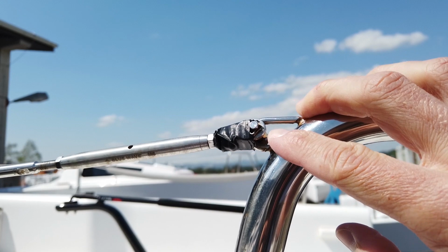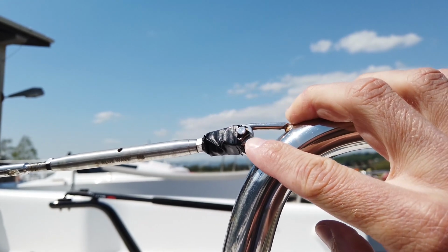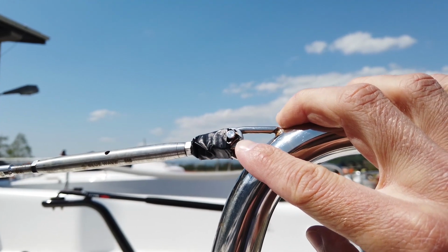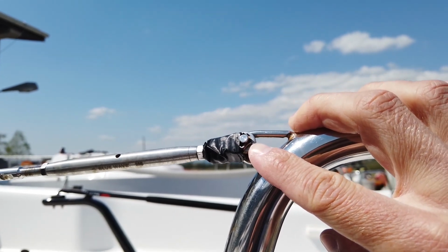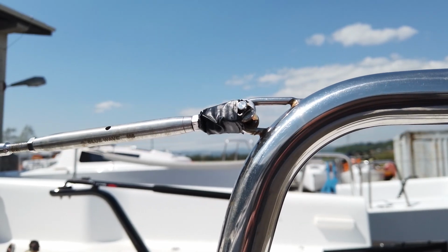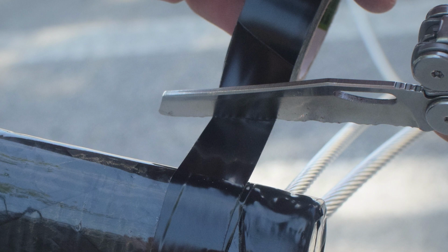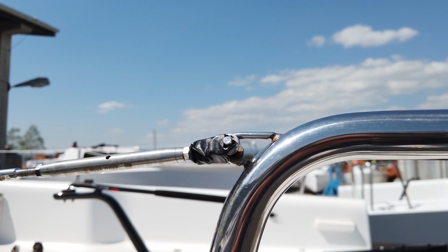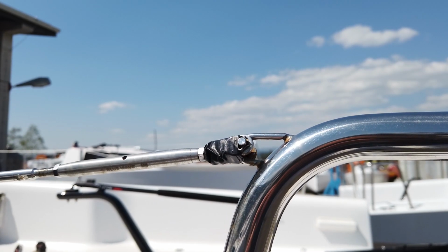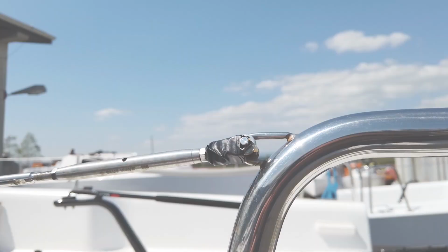I suggest you have the safety pins on the outside and properly tape them with electric tape. Both together can save your sailing jacket or lycra. A simple trick when taping the pins: don't tear the tape when you are doing the final round, but nicely cut it with a knife. Overstretched tape will very soon peel off, while nicely cut tape will last for the whole season.